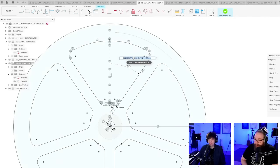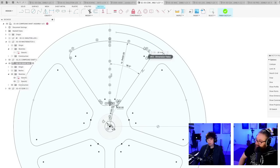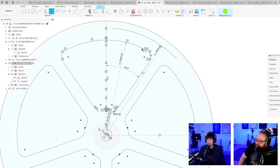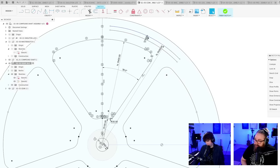I'm going to copy this function. So look, now I'm going to make this arrow parametric with a function here, Hannes. Are you ready for this? Oh, I am ready. So I'm going to paste this function, but instead of 80, I want it to be like 3 centimeters from the edge. And then we're going to offset this. So the arrow is 15 millimeter thick. And this arrow